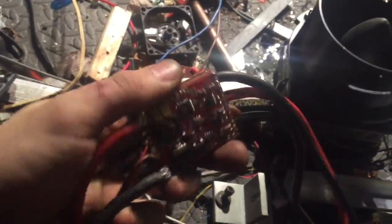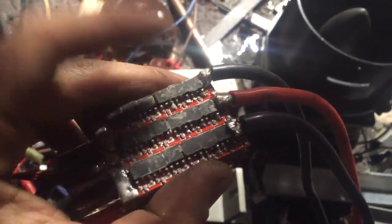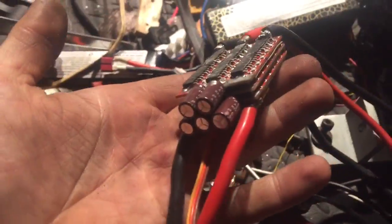I'm going to probably have the power wires going back up to the back rack thing here, where I'm going to have the batteries and the speed controller, this 200 amp Hobby King red brick thing, little junky thing. Had to fix it. It was barely soldered on. I upgraded that to 8 gauge wires. I might put a thermoelectric panel on there. But I'm probably going to have that up there along with the cooling pump and the radiator, with the cooling lines going to the motor.